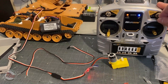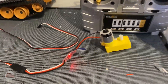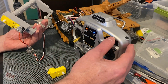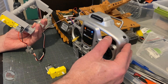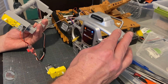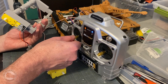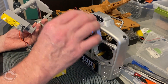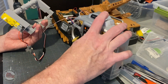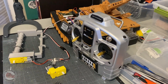Then it was time to hook this up to the electronics, and that was pretty easy. I just gave a channel over to the motor and hooked up an electronically controlled switch. When I flicked that switch on my remote, it powered the motor, and the power came off the battery running the tank. Everything was great. Running it full on with the cylinder looked great, and I still had the functions for the elevation of the tank gun — nothing was interfering. That was exactly what I wanted: just plug and play with the existing system.